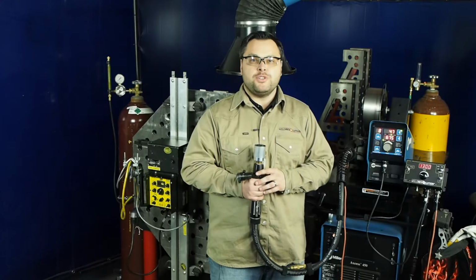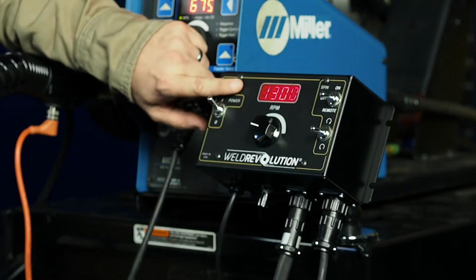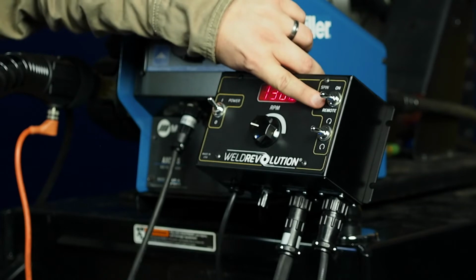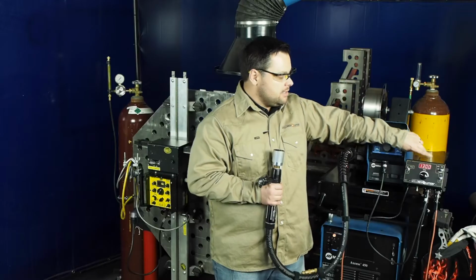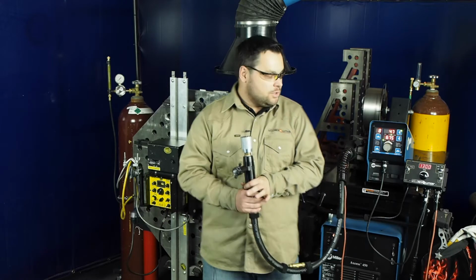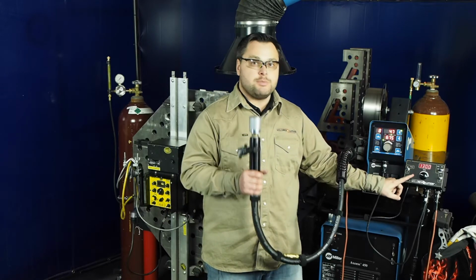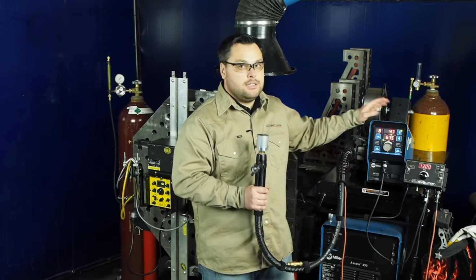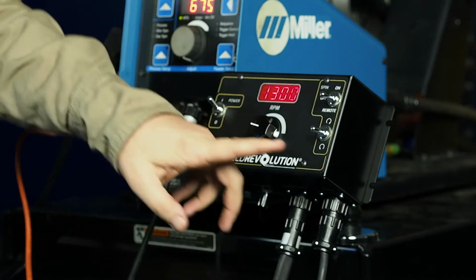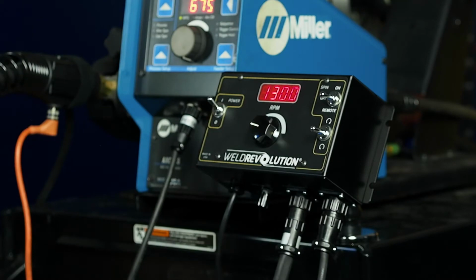The wire rotational speed will be 1,300 RPM. I'm going to have this in remote mode. And what that means is that the Bug-O, when it's switched on, will trigger both the spin and the welding arc at the same time. I'm going to also weld with counterclockwise rotation.